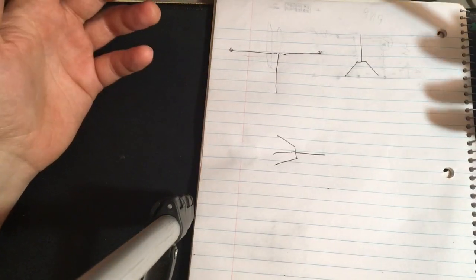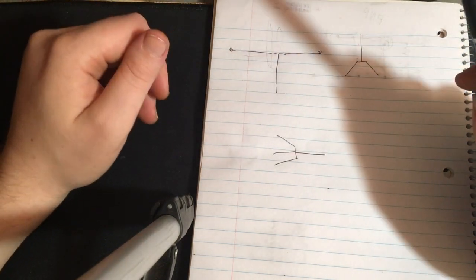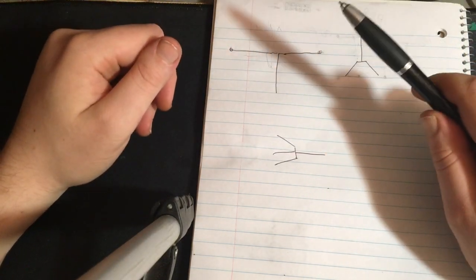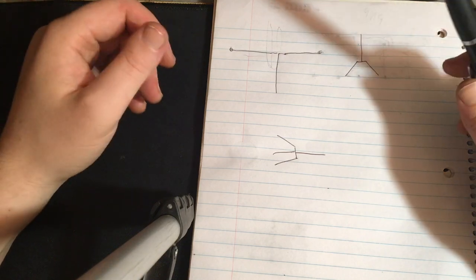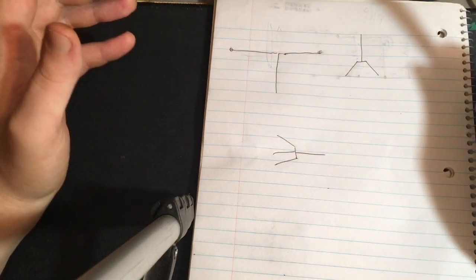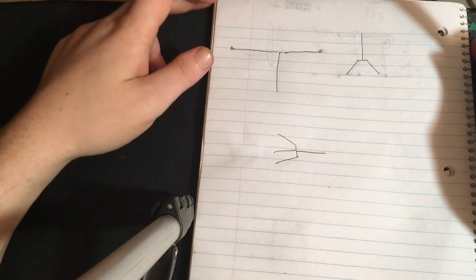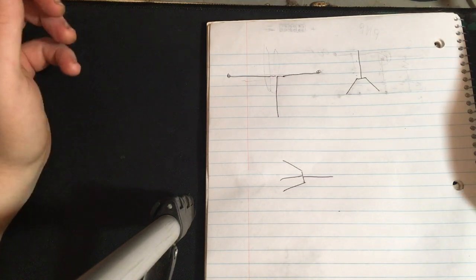Now, I could have, of course, made a 102 steel whip and put radials on it, but this is for the most basic antenna that I can think of in teaching how to build, and the radials are a little bit more complicated to work with. I wanted to do something quick, something easy, and something that anyone could do, and I don't think it's a bad antenna at all. It's going to be a hell of a lot better than any shortened antenna that you can get.